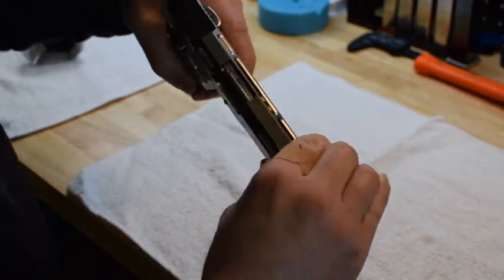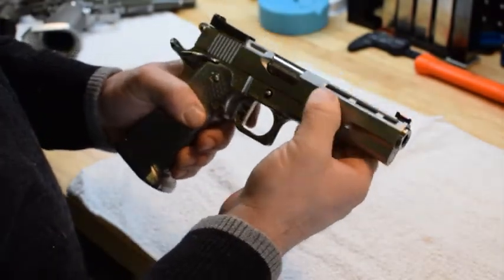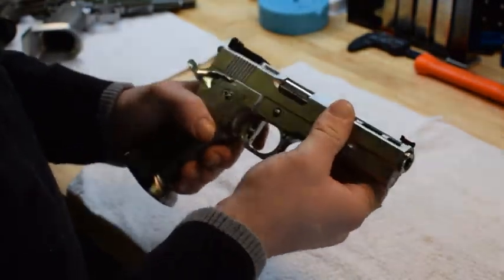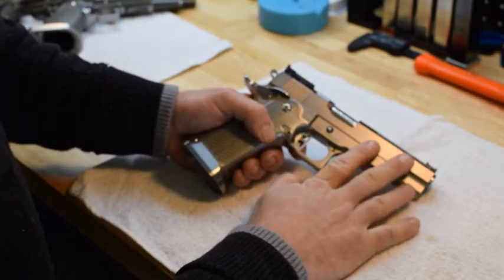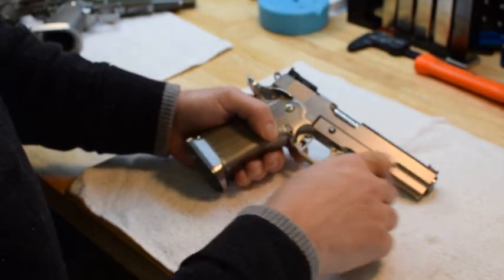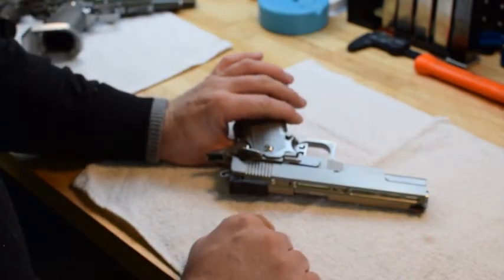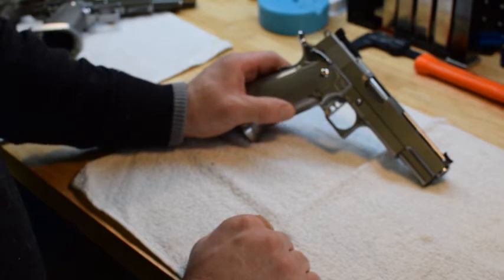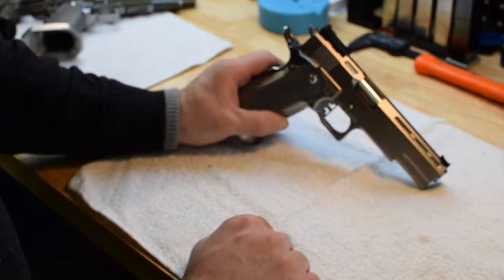And you get a nice perfect fit — I mean this gun has zero wiggle; this gun is as tight as they come. On a side note, everybody worries about the frame-to-slide fit, but what really matters is the barrel-to-slide fit. Barrel-to-gun fit is what makes a gun accurate or not accurate. Hard chrome works just as well as electroless nickel for wear — they're super wear resistant and abrasion resistant, they look good for a long time, and it takes forever to wear through these. These are probably the longest-lasting coatings. You could probably get a used gun, do 20 years and 150,000 rounds before it really needed to get redone again. The PVD stuff might go that long but it won't look as good doing it.